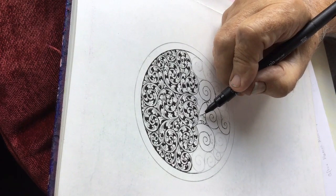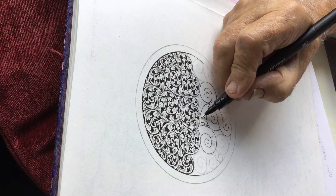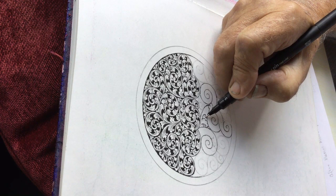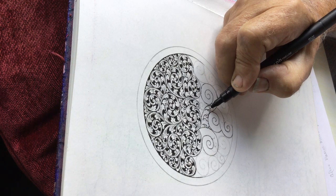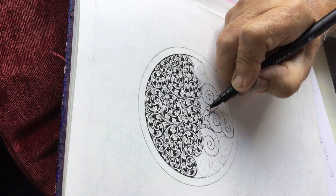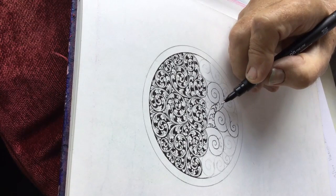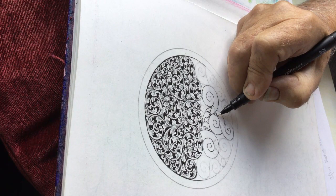So now I have this. Normally I would draw a longer line around and I would flop it down quickly. This one, as you see, the small background is cutting away, so I'm doing a shorter movement and then I will put the knob on here like this. The Austrian and the German engravers did this regularly without a lot of shading with a hammer and chisel — it was a traditional look on their guns. But it didn't have the finest engraving of the English engravers. The Germans had what I would call the Black Forest woodcarvers style.